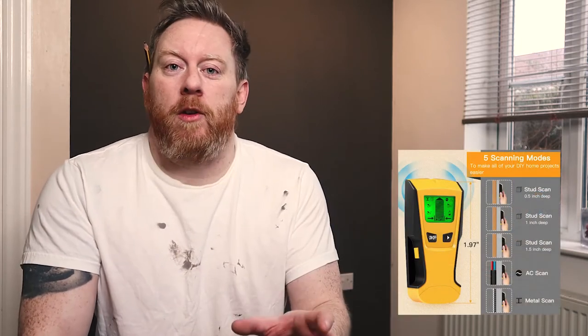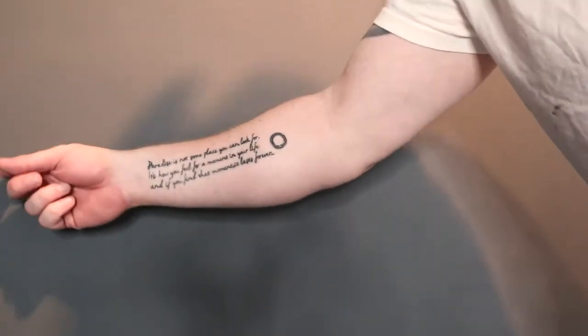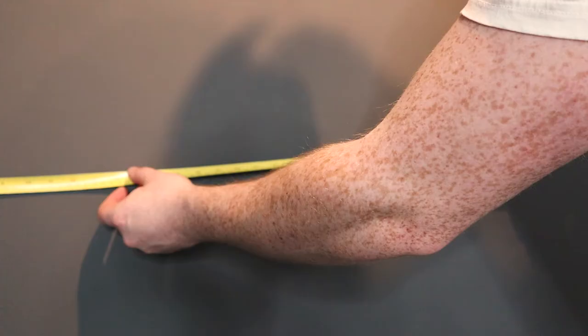To find the studs we're just going to tap across the wall until we hear the difference in sound. You can get stud finders but that's another expense — borrow one if someone nearby has it. Same with electrical cable detectors — always worth investing in one if you're unsure. In the UK the distance between studs is usually 400 to 600mm, so they should be spaced about that. Now we've located the studs we just need to place markers, use the spirit level, and get the battens fixed to the wall.